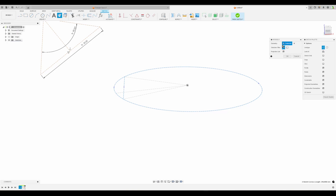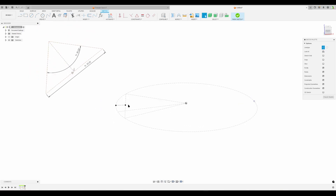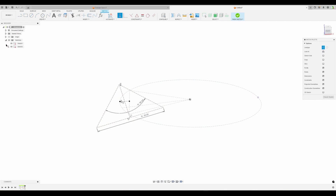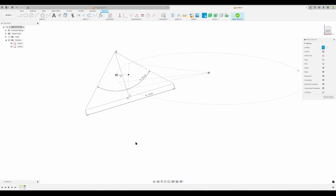I select the intersect geometry - can't spell as usual - select this and hit OK. I make a small line from here to here because I know the center line of this face. I want to make the first layer symmetric around the previous sketch plane, so I do a midpoint between them. We have it placed, but we don't know the angle. Either this point needs to be vertical above here, so I use the horizontal/vertical constraint from here to here.